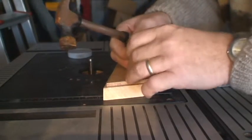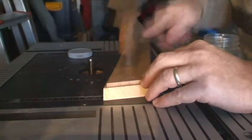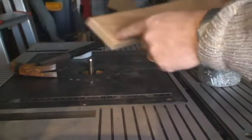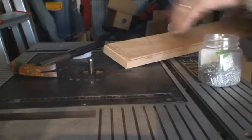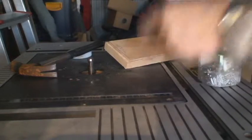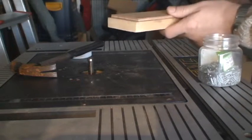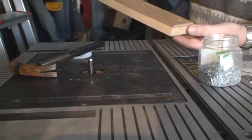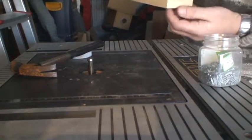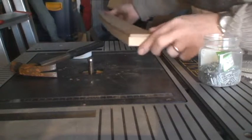One more down here. This is the forward end, so this end here of our wood is up against the bow. You can actually see the angle of the bow here. We actually have to trim this when we build it into the boat, so I actually won't trim this end of the girder. Just gives me a little bit more safety margin in case I've made a mistake. The other end here I've actually cut on the bandsaw right up to the line. The bandsaw cuts across the grain quite nicely, which is why I've done that.